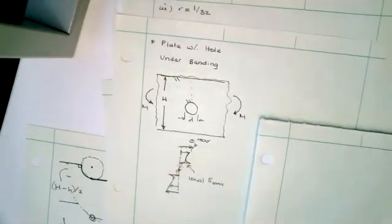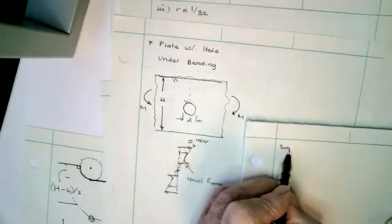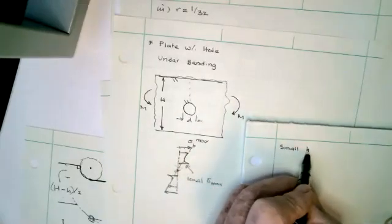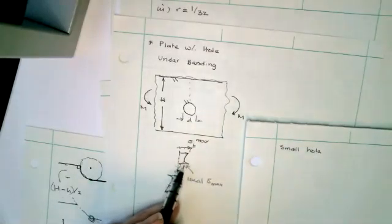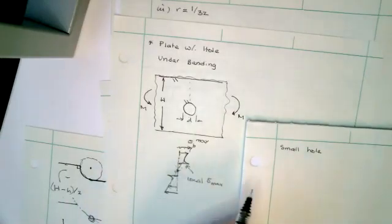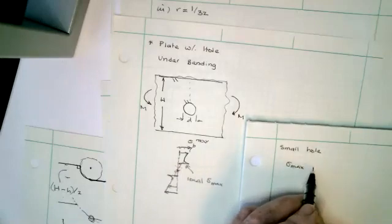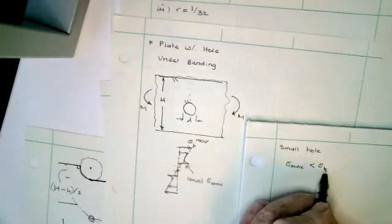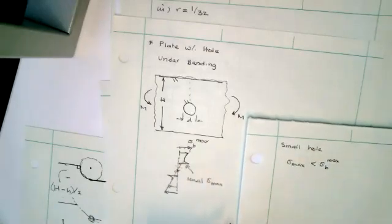Have a small hole. Not a pinhole, but a small hole. Then the stress that got redistributed here was pretty low. And so this local sigma max may be less than sigma B max. So if we had KT,